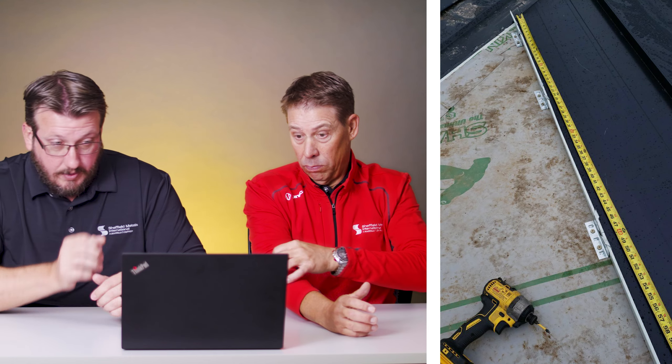Love it when they measure. I can't tell people not to use impacts; I just try to encourage using the proper tools that fastener companies suggest — and it's just not an impact. Cleats stripped in. Looks like the right fasteners, looks like it's the right clips. Overall not too alarming. I'd like to see a little bit cleaner surface that the roof is going down on. Hopefully there's not mud underneath there — everywhere around it could be a mud pit, we just don't know.